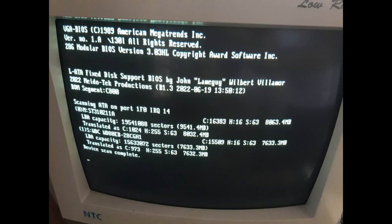I wonder how that diagnostic disk is going to react when it encounters a drive that it can't find a type table entry that matches its geometry, like, say, a CF card. But no sweat. I've made my own solution from scratch that should help me get around this problem, and possibly others. It's actually written for AT systems, and not some vaguely popular IDE BIOS that doesn't really have an author attached to it, and is highly fragmented, and yet people are still using it. People claim it'll work on AT systems, but other people claim it doesn't work very well on some earlier AT clones. Meanwhile, my solution works properly.